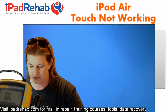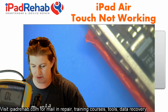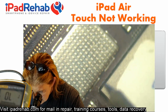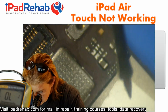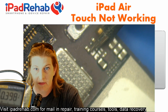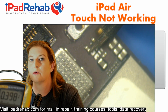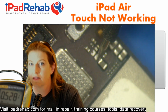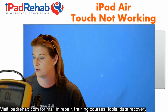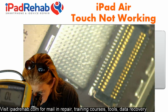Okay, and let's compare that to a known good board. These aren't known good, but they are not known bad. How about that? Well, that's probably not going to tell us very much because he's missing that chip. That means somebody's been there before. All right, so on this side, 0.398, and the other side, 0.528. We'll call that close enough. There doesn't appear to be a short to ground on that enable signal. So I'm glad that we tested that out and ruled that out.